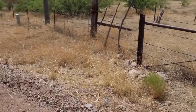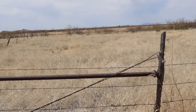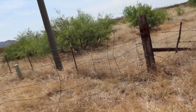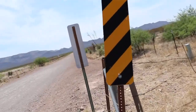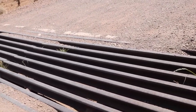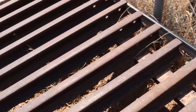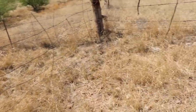This is probably one of the highest points of the property. If you're water harvesting, you always want to start at the top of the watershed and then work your way down. Collecting road runoff can be an incredibly powerful and useful tool if you can take advantage of it. What we have here is a nice little dip that would catch an amazing amount of water — not only from the road but from the surrounding area. I can just see a ton of water coming through this cattle guard and then running along the side of the road.